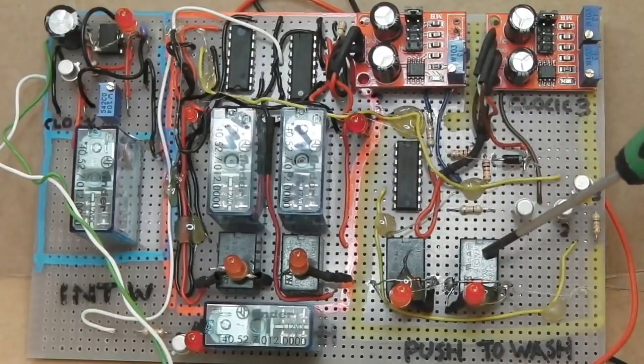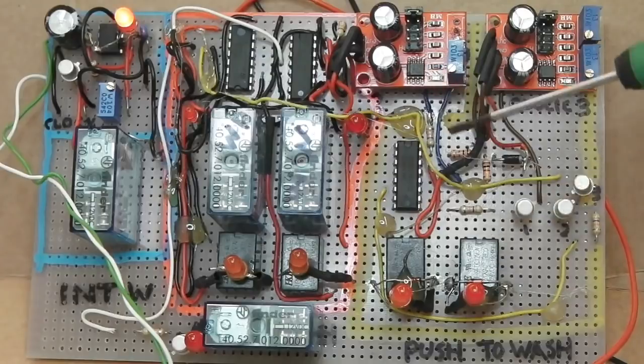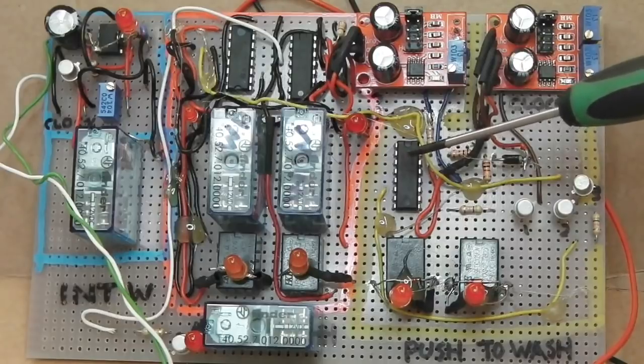There's two relays. One's a self-latching relay and one's what you call a cancel relay. This relay, I think it's this one, could be the left one. One of these, as soon as I hit the switch, the washer jet locks on. It waits then till you release the washer jet. Then the chip begins to count the timing pulses coming out of this separate time clock. Gets around to an appropriate point.